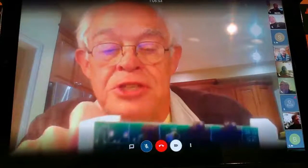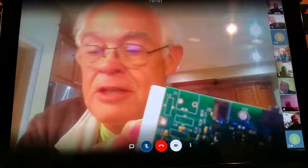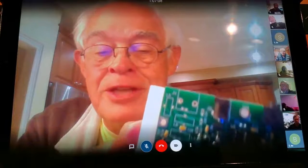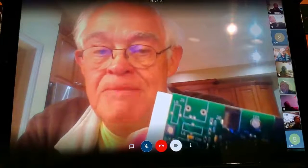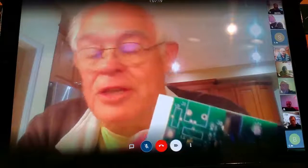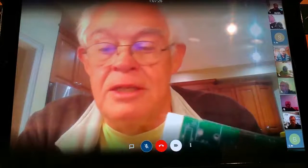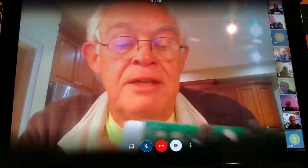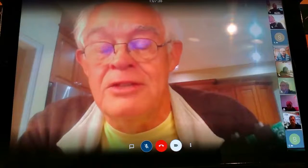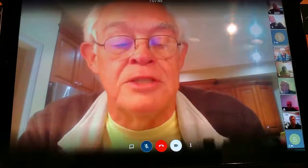I finished stage two, I think, the day before yesterday, and guess what? I'm not getting the reading that I should to prove that stage two is functioning. That's the one that involves using WSJT on my PC, with an audio out that goes into the phaser. I should have mentioned that the phaser is a digital modes rig, all digital modes. You drive it from WSJT on some device like a laptop. Anyway, I'm on stage two troubleshooting. It has a separate troubleshooting guide to say, look here, look here. If it's not this, then look there, which is very nice. I really like building in stages.